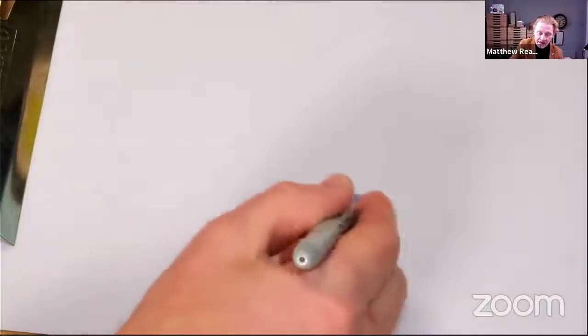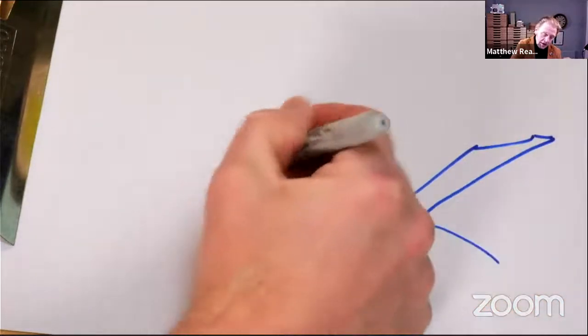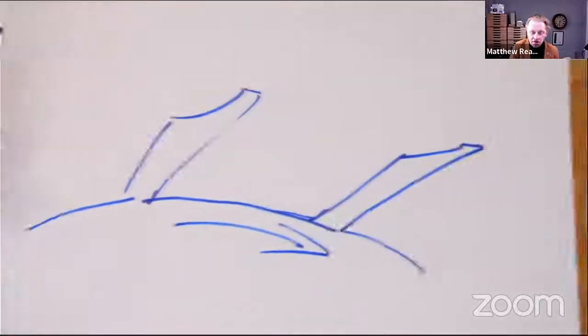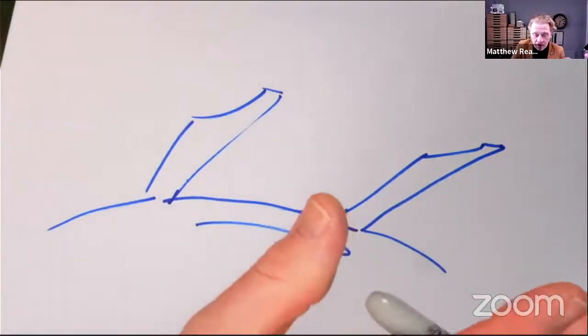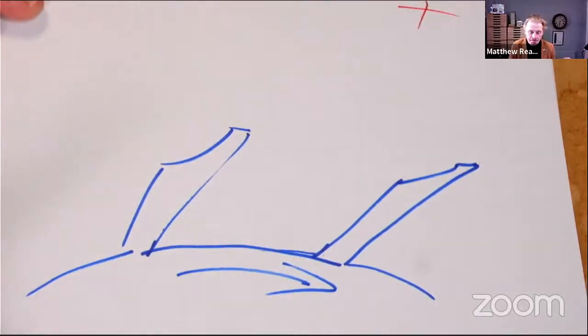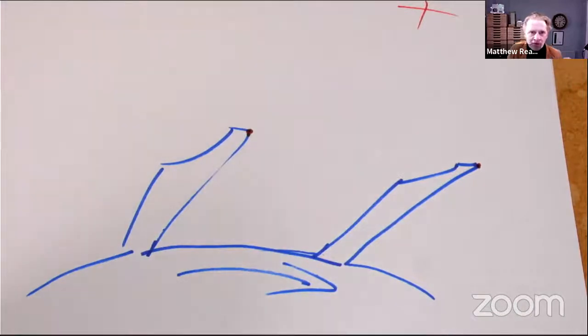So for people who haven't seen this, let's just say we've got exactly the same escape wheel. So here's a tooth, like that. And here's another tooth like that. Same thing, wheel going in a clockwise direction. So rather than the pallet face being struck from our center, which is somewhere up here, the pallet arbor, if you imagine the deadbeat escapement that we're familiar with, it's basically points in space. It's a point there and a point there. The shape of the tooth is irrelevant because it just creates something to hold that active surface in place as it moves through space.